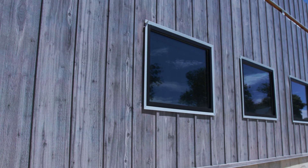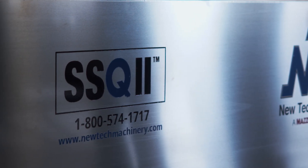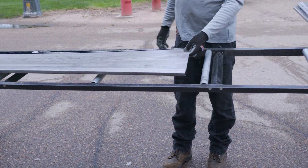We've already seen some really cool projects using print coat technology that makes a panel look like wood or another material. Some of the wood patterns out there actually look better than real wood. Board and batten has been around in metal for a little while in the plant market, but having it in a portable roll forming machine is kind of a game changer. It's one more option that New Tech and portable roll forming suppliers can offer customers to compete with fixed in-place manufacturers. If you've already invested in an SSQ2, it's not much of a stretch as an add-on.